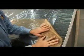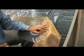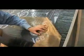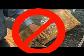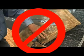Install the Z-Mesh following the layout performed earlier. When installing the Z-Mesh on a wood roof deck, attach the Z-Mesh using staples at the base of each fold. Be sure that the staples don't come in contact with any electrically conductive material, and be careful not to tear the Z-Mesh while installing staples.